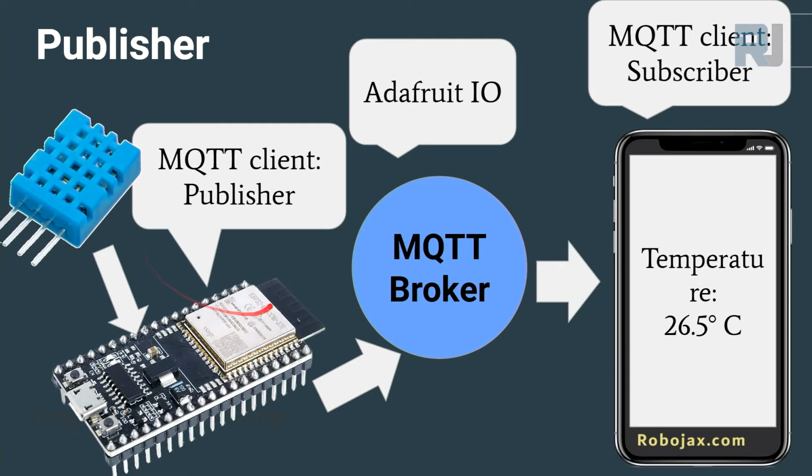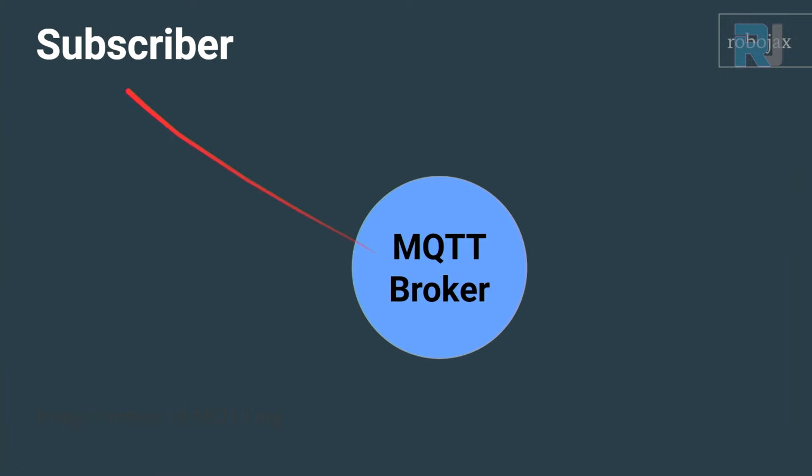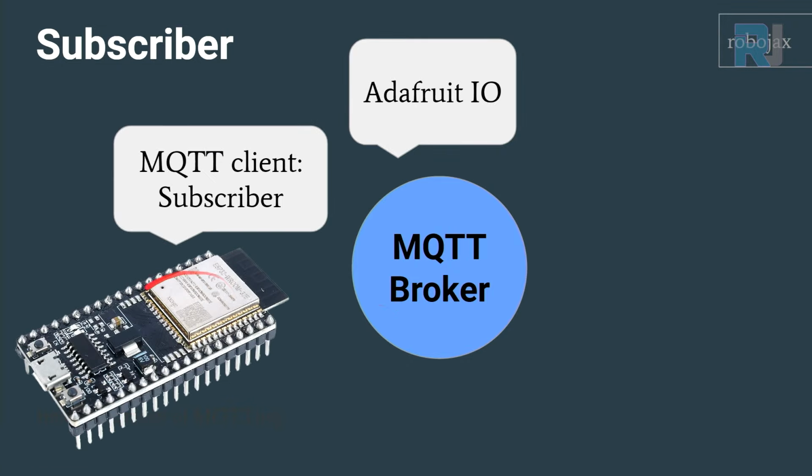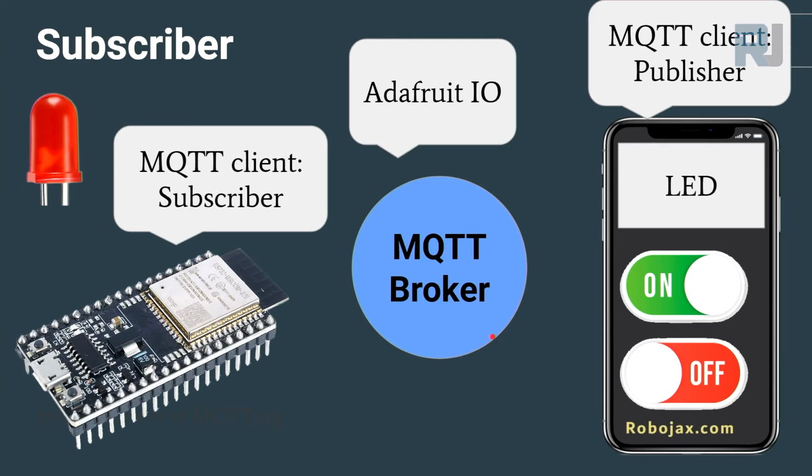That's how it is used as a publisher. Now let's see how we can use it as a subscriber. We have the Adafruit MQTT broker service, and the ESP32 is now used as a subscriber, and we have subscribed to a topic called LED. The MQTT client, the publisher, is publishing on/off to the MQTT broker.